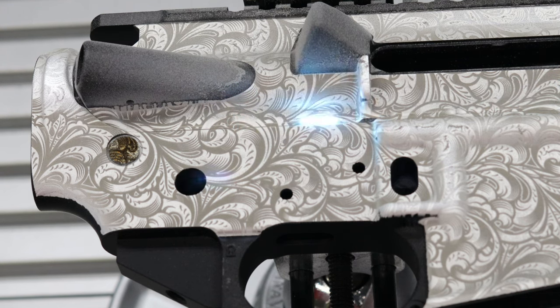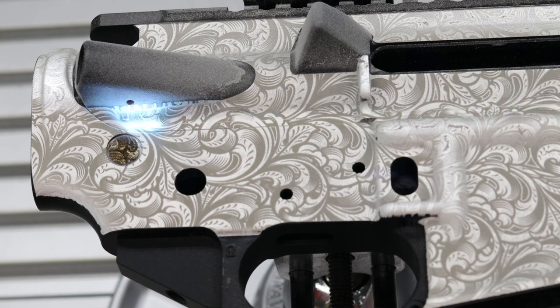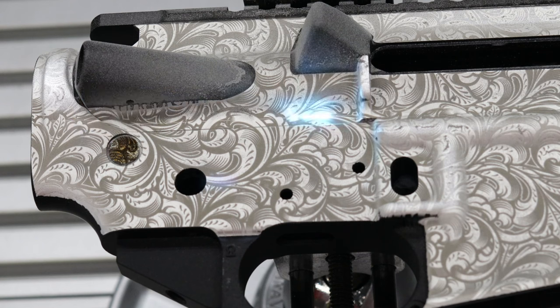The lines, spacing, and hatch pattern. It's in my machine. I don't know if it's the same for y'all's. It's called bi-directional, which is like 0 degrees and 90, so it's like a grid. And it's usually between 0.015 millimeters and 0.04. It really depends on what I'm doing. If this was a steel receiver, which I don't even know if they make those, but if it was something steel I was engraving on, like if you watch some of my other videos, the contrast can make it look a lot better, where the dark is supposed to be. Aluminum doesn't allow me to do that very well.